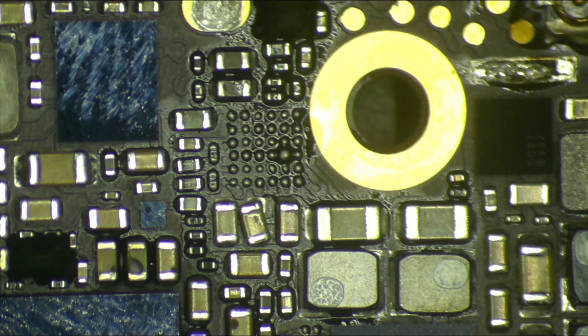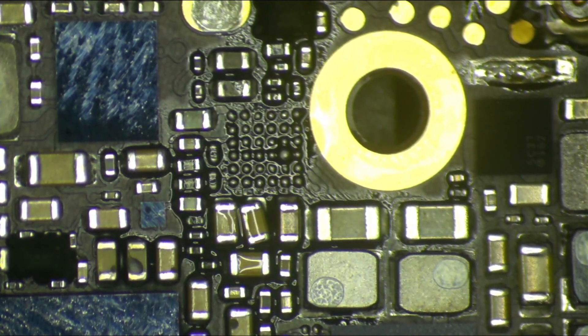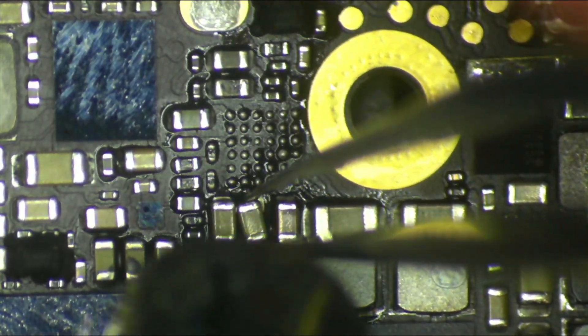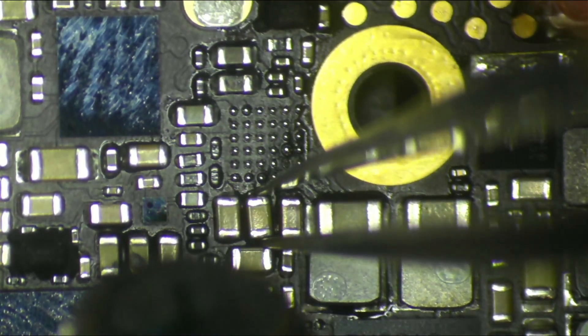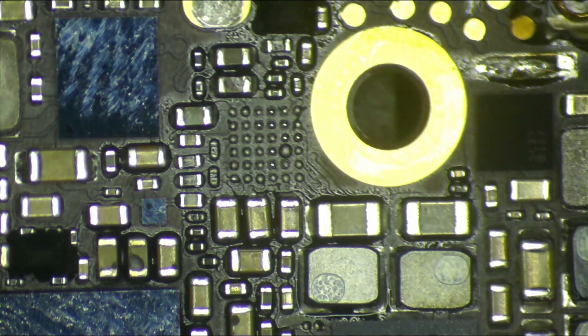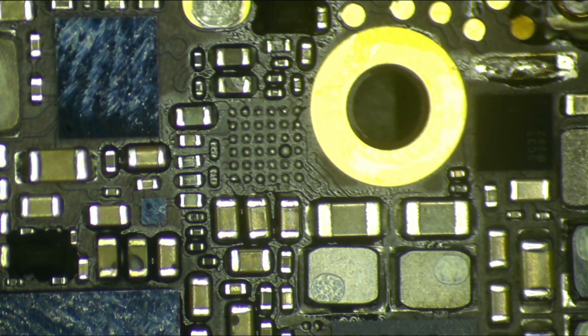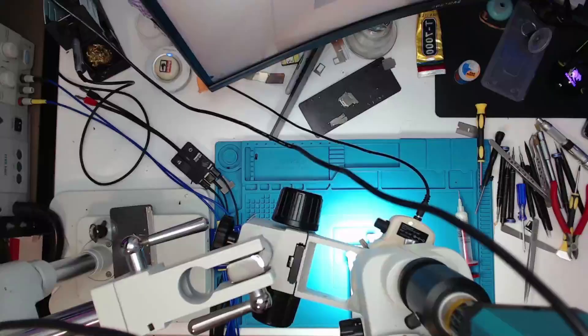Obviously I slipped and moved that cap — that's no good. We can just move it back in place like that. Now, one of the questions I want to cover is: why doesn't stuff go flying everywhere? So if you liquefied the solder enough and then blasted it with enough airflow, they would probably come flying off. The reason why they don't is that there's not much weight to them and the surface tension of the solder keeps them in place anyway. Number one question gone.